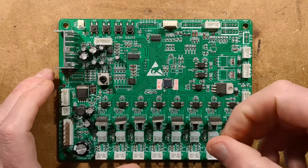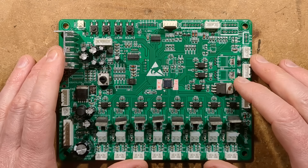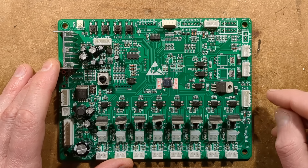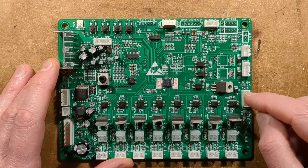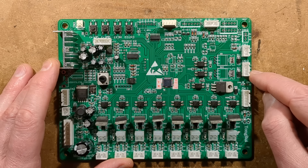It's got watchdog, it's got all the power management, it's got on-board debugging — it's actually a very capable little processor, quite neat. There are three MOSFET positions here. This one appears to be going to a connector marked 'price', so it's possibly for controlling a prize-dropping mechanism. Then there are a couple more MOSFETs for auxiliary outputs.